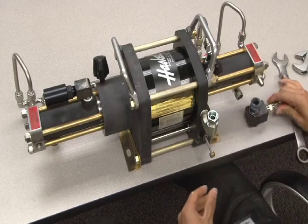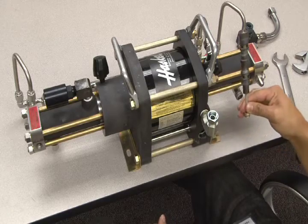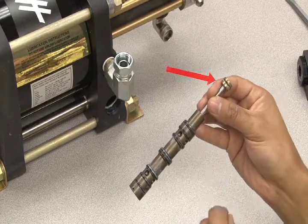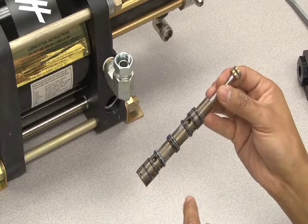Remove this section and place it to the side. Now you can pull out the spool assembly for maintenance. Notice there are 8 same-size O-rings on the spool and a smaller O-ring located on the shaft. O-rings are also located elsewhere in the unit, including the sleeve and pistons.